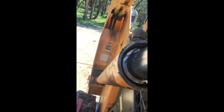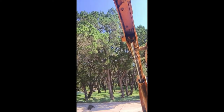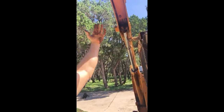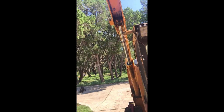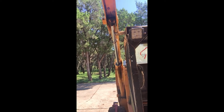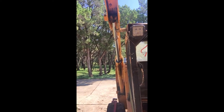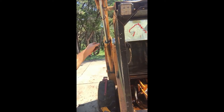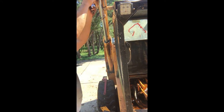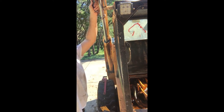Hopefully you can see that snap ring in there. I'm not going to video the snap ring removal because it's time-consuming. Now I'm going to take that cross bolt through the pin and take that out — push the pin out. Don't use your finger because of the way that can pinch it as it falls out. Use a handle of a small hammer or something like that, preferably not a screwdriver. I actually have an aluminum rod I'm going to use. I found out that if you actually push the snap ring in, it pops right out — grab it with some pliers and pull it out. These are 9/16ths, though your machine may be different.